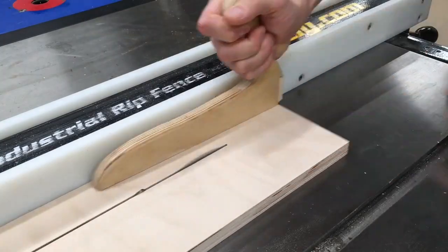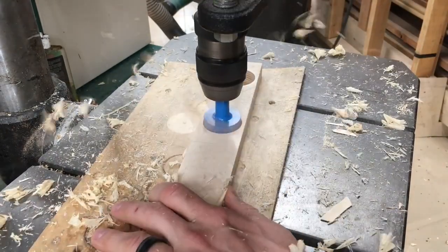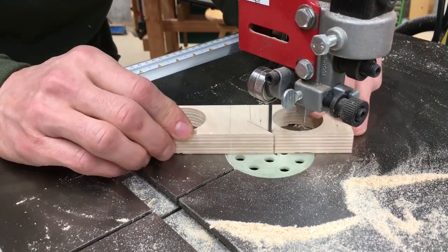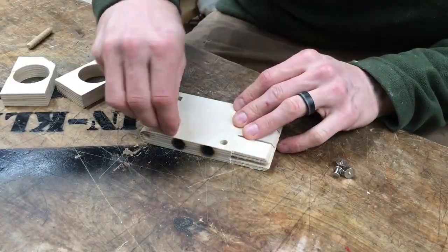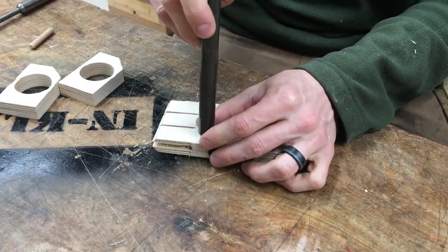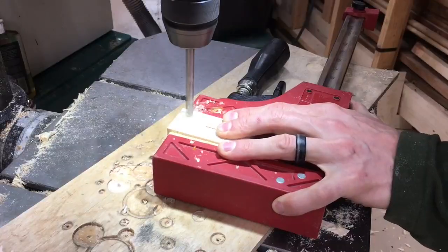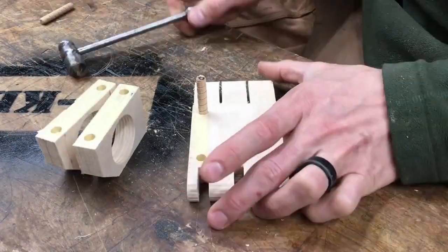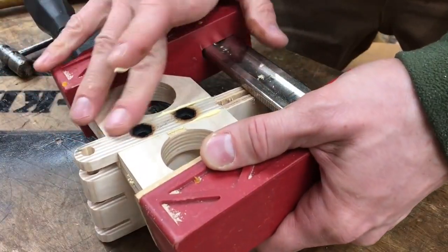Next it's time to dimension the base that will hold the magnets. If you want the super tight snug fit that I get, you need to buy a 40-millimeter bit. A 1 and 5/8-inch bit works just fine — there's a little bit of slop, but you'll never know once they're installed and there's still plenty of room for the screws. I'm using 5/16-inch dowels to join the two base sides to the body of the tool. I drill those holes first, then use dowel center pins to transfer the marks onto the two base pieces, drill holes in them, put the dowels in so they're sticking out each end, and glue it all together. I make sure everything's flat on the bottom — I threw a couple extra clamps on a flat surface to ensure a flat bottom.